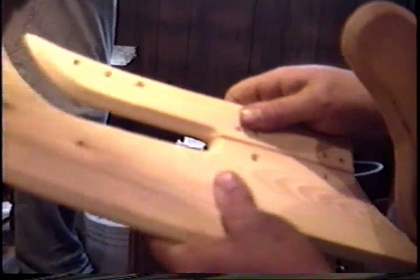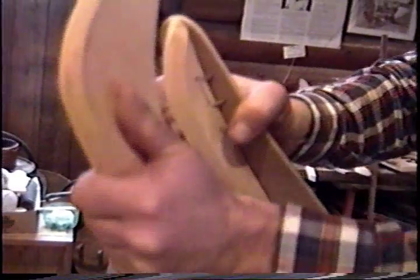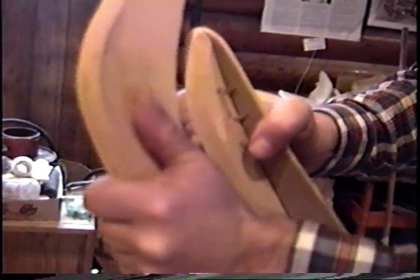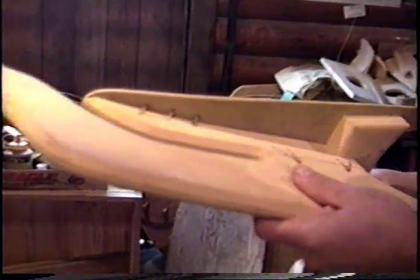When this gets tied, it cannot move in any direction. There's always a little bit of give and a little bit of play, and that gives a little bit of shock absorption in this piece. If something violently impacts it, it's going to give and stretch rather than break. That's why we don't use any glue in this. The bow plate is white oak and these pieces are yellow cedar.